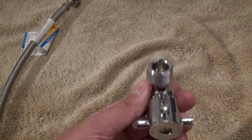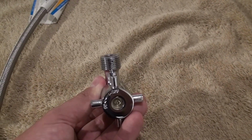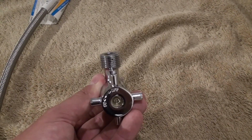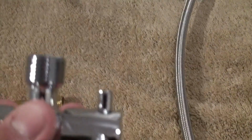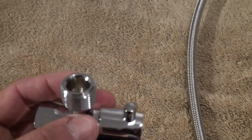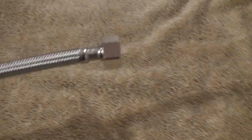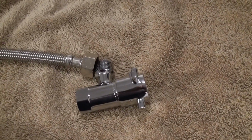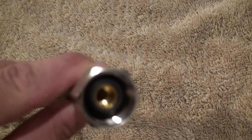That could be either screwed to the end of this brass or mounted in another way, but eventually it terminates the water coming to maybe a mixer tap or a set of basin tapware. So what you can see there is also a piece of 1/2 inch or 15 mil thread sticking out of that. And the idea is that the flexible hose connects to either that or even the brass thread. But what you'll see inside of the flexible hose is a rubber. So I'll just zoom in a bit. There we go. I'll zoom back out.